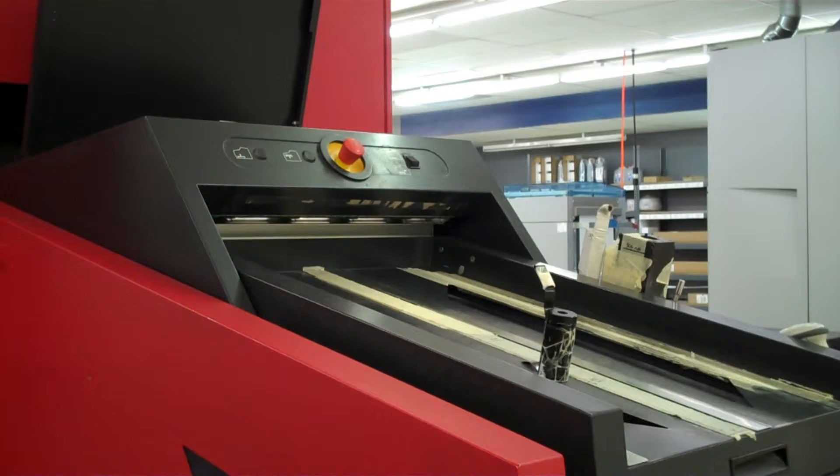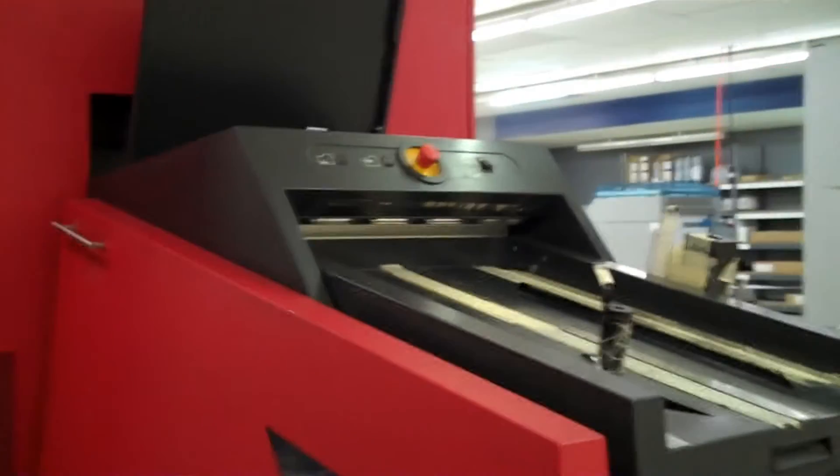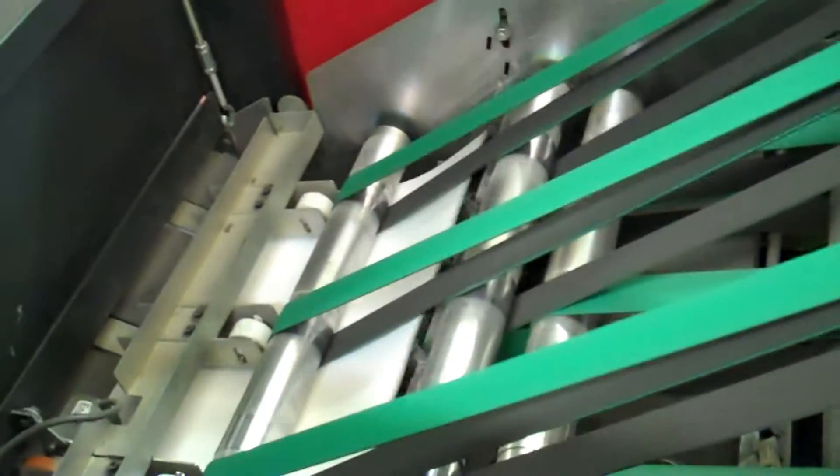You'll notice that a lot of times the lag in between you sending off a job is warming up the fuser — it takes a little bit of time. You can see the fuser is up 91%. Once it says it's ready, it'll usually start spewing out paper pretty fast. What you're mostly looking for is that it doesn't jam up here. Sometimes it'll ram right into there and you've got to wiggle it, but it seems to be coming out pretty good here through the paper handler.